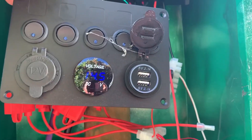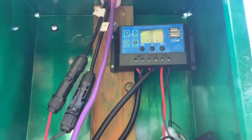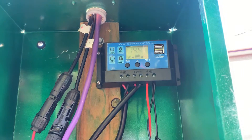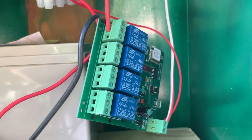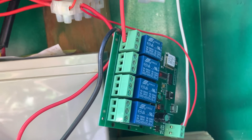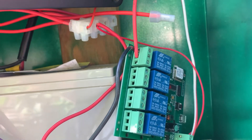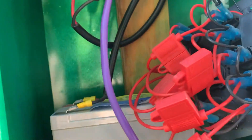I've got a marine panel here — pretty cheap — that's used because everything's set up with the switches, fused, with a voltage meter, USB sockets, all in one. I just have a deep cycle 12 volt battery there and a cheap eBay 12 volt USB solar controller. And down here I do have some things hooked up already — it's a Wi-Fi controlled relay switch. This can work in conjunction with the Wi-Fi sensors already in the greenhouse to control heaters and the heat lamp, and if the temperature gets above a set point, I can have this automatically turn on ventilation fans. What I can do with it is endless.